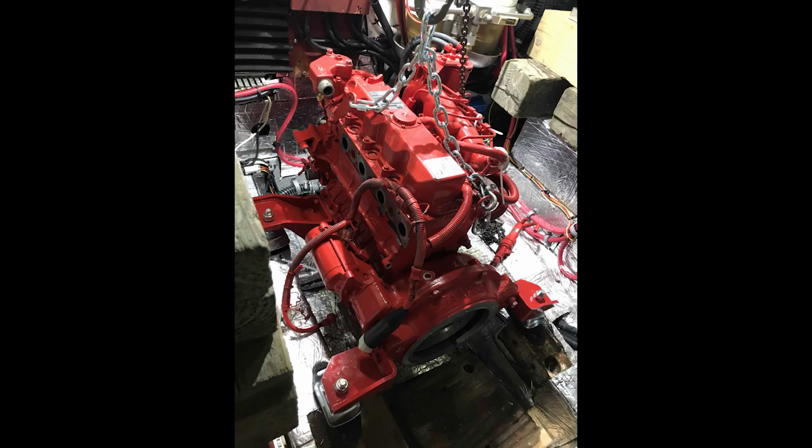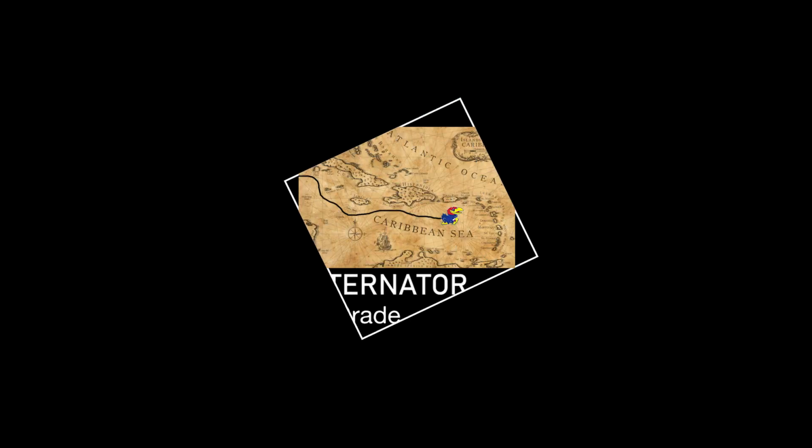So here you see the end product of about 4 hours of work. You see the come along chain at the top there. Also, we put back on the flywheel, clutch pack, bell housing, motor mounts, and chassis mounts. This allowed us to position the motor roughly in where it's going to go. Next week, we'll be working on the stringer mounts and final alignment.